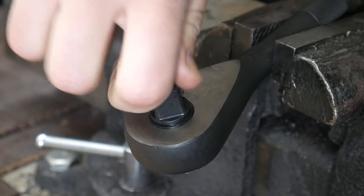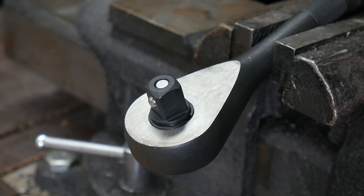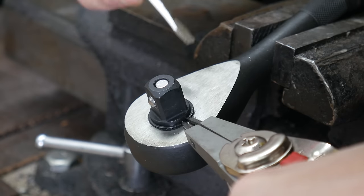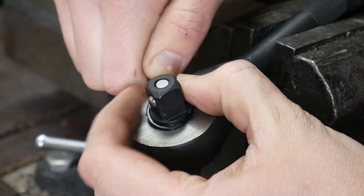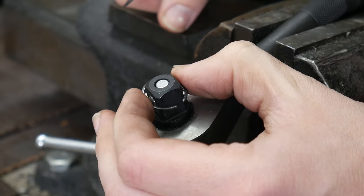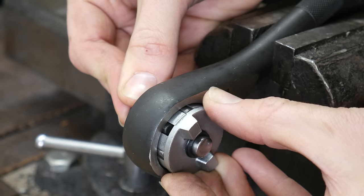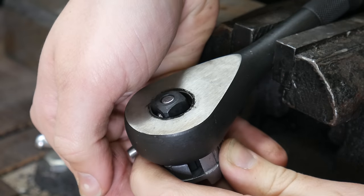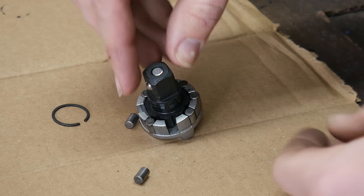In order to take this thing apart, we'll start by removing the little snap ring that retains the drive head of the ratchet. It's funny to have been using ratchets for so long and realize that I don't actually know what this part would be called — the drive square? Drive assembly? The anvil? I'm not really sure, I think I'm just going to call it the drive head. We'll use some standard snap ring pliers to spread the ring open and then lift it up with a flat blade screwdriver to keep it from popping back into place. Then we'll lift up around the perimeter of the ring until we can completely remove it. Then, if we start pressing on that drive head, it does seem like it wants to slide out. With the assembly halfway out, we can start to see how these work. We'll just give this a push and make sure we catch all of the pieces as they fall out. And that's the entire body of the ratchet — it's just one piece and an open chamber. This mechanism here is where the magic happens.